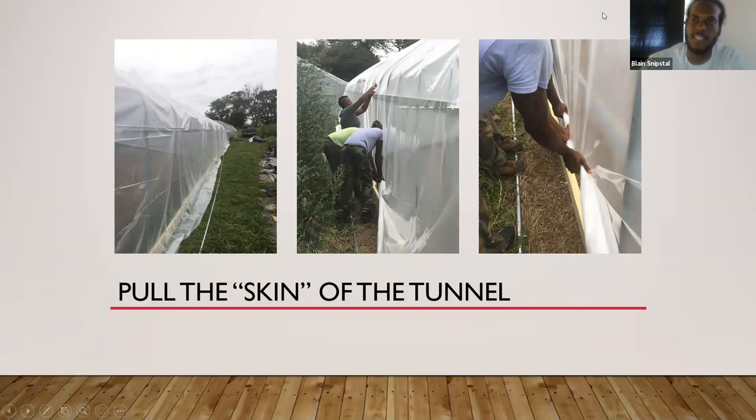As you can see here by this picture, there's a very specific technique to do this. You roll up the plastic like you're rolling a Tootsie Roll, or like a taquito. Is that how you roll a taquito? Or a burrito, how about that? Then you are palm side down, applying downward force pressure to make it as taut as possible. You don't want your knuckles in the plastic because they will blast through that plastic with the amount of pressure that you have to put down. So you want to roll it up and then just push down, as you can see here.